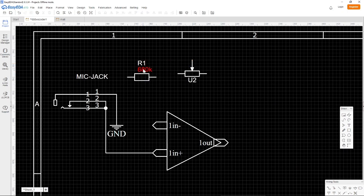Because each component is attached to one footprint. So this is a symbol, and the symbol also carries information about the footprint. When we have drawn the schematic right here, then we press design, convert to PCB, and then we get all the footprints. So that is the drawing that will go on the PCB that is sort of the same size as the component itself. We can just say that they vary in size and in design and all that.